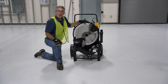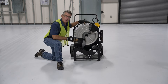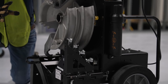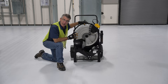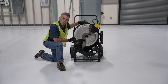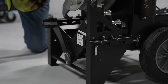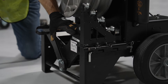Consistent, high quality bends start with the bender itself. The bender must be very rigid and stable so that it has a very stable mount for the roller assembly, so that the rollers are stable and rigid and the conduit can be guided very accurately into the bending shoe for high quality consistent bends. Notice, for example, the bracing across the front — that minimizes movement of the feet and it keeps everything stable, including the mount for the roller assembly.